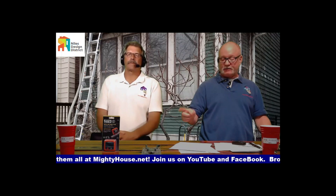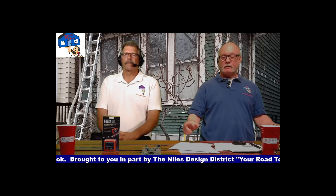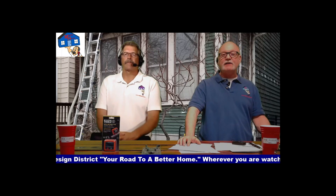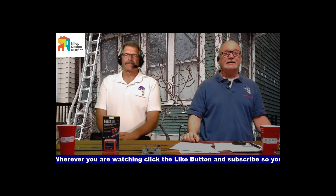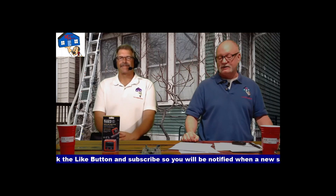To summarize: attic insulation and air sealing will cost you about $475 per air change of savings. Dense-packing the walls all the way around a roughly 2,000–2,500 square foot two-story house runs about $7,800 and saves you 3 air changes per hour. But replacing 35 windows saves you less than half an air change per hour — because those old windows still have glass in them, and air is not going to pass through glass any more than it passes through new glass.